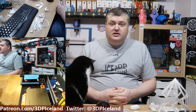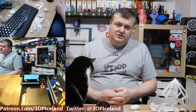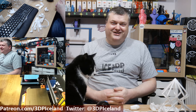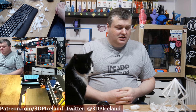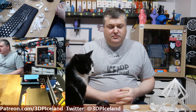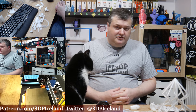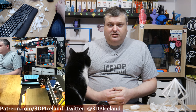Those were the prints I did with the Nylon Extra filament from Filamentum. I was quite happy with the strength of this nylon. In the beginning I struggled with layer adhesion, until I found out that part cooling was not a good option. After I turned part cooling off I was getting really strong models. Even though I get quite a lot of stringing, I think that's pretty normal for a nylon filament — it's nothing that can't be cleaned up. I was getting some blobs on some other prints as well, but nothing that I couldn't clean up.